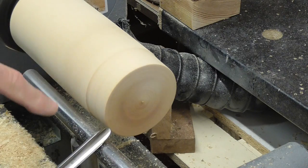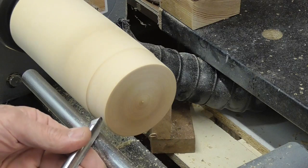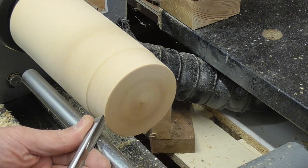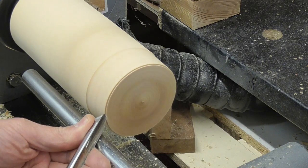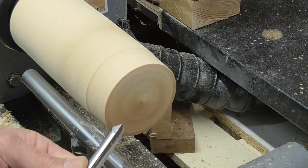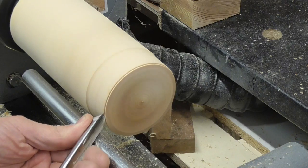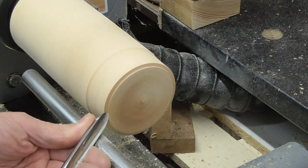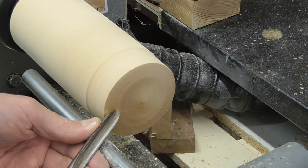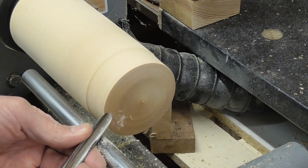So what I need to do is — let's just clean that up a bit. Now if I want to start my cut here on the edge, I can go one of two ways. I can either go in with my thumb behind for support and go in virtually at 90 degrees, and then as soon as I get the cut, turn and I'm carving the cut with bevel support. Thumb behind to hold, bevel the cut, then twist and maintain that bevel contact. If you pick the cut up there you've already got bevel contact — lift the handle and start the cut.